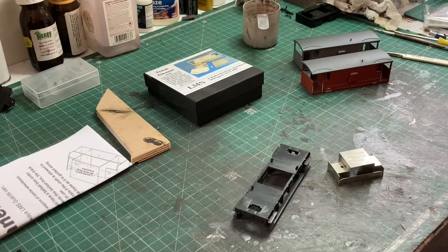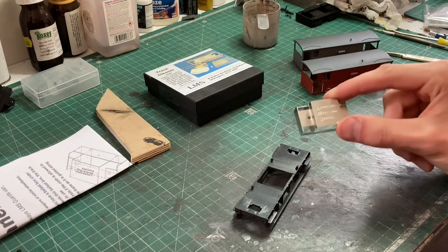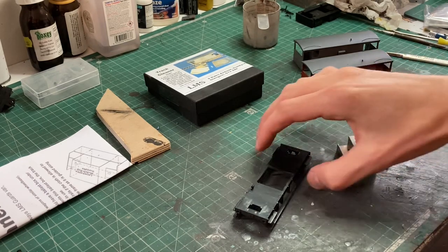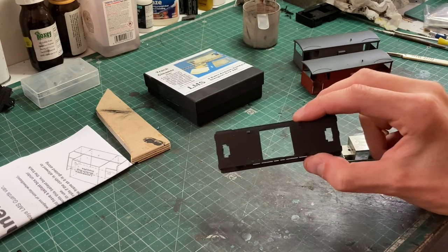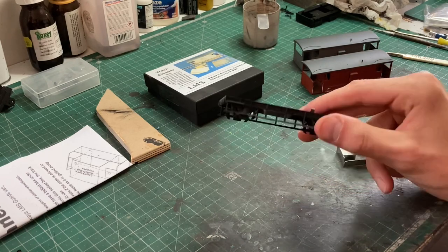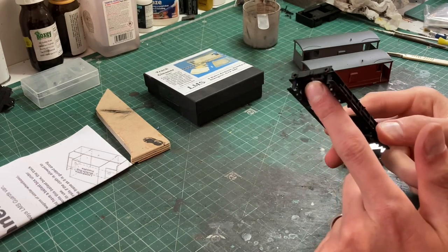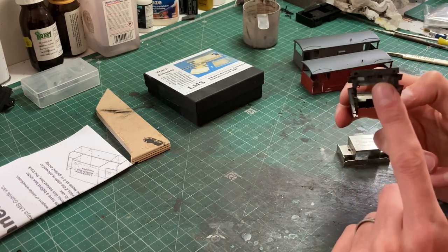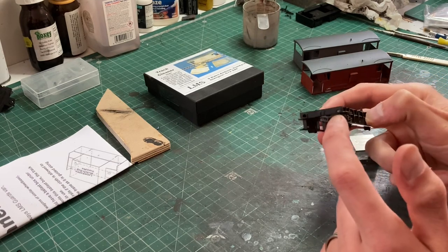Okay, so having finished soldering now, I've got my track cleaner box, it's complete. All soldered together and ready to go into the wagon. I've got my wagon chassis. You can see I've cut the hole in the bottom of it that is required. While I'm at it, I've also removed the big bulky tension lock couplings because I'll be replacing those with three links. I've cut a slot for the new three link coupling to go in,